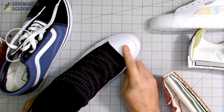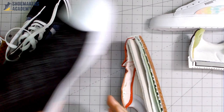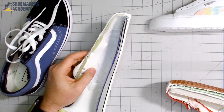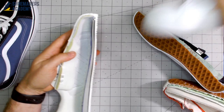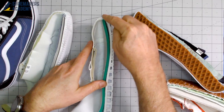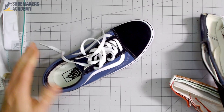For the bottom, just like shown in the picture, they take a sheet of rubber, lay it on, and wrap the tape around it. That's pretty much what a vulcanized versus cold cement construction looks like. Here's the shell toe Superstar — you can see it's all one piece of rubber with the midsole dropped inside. Here's a Puma with the same style: a little egg crate inside, but it's all one piece of rubber, and the upper is just glued onto it. Versus the vulcanized process where rubber components are assembled onto the upper and then the whole shoe goes into the oven.